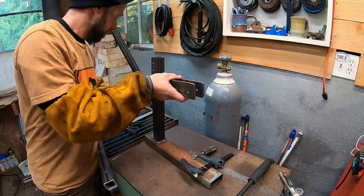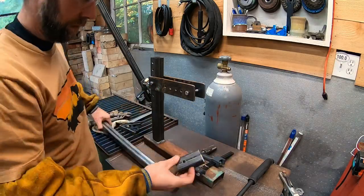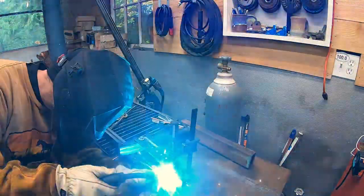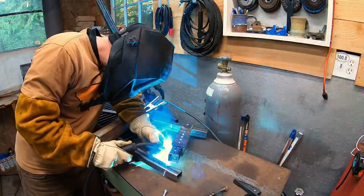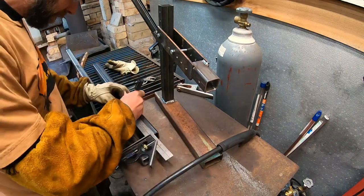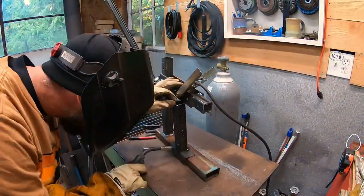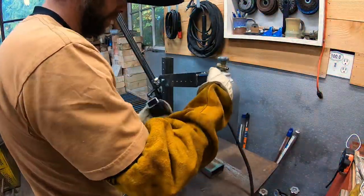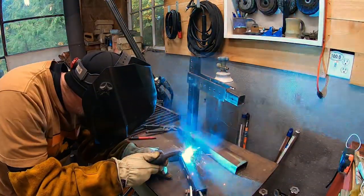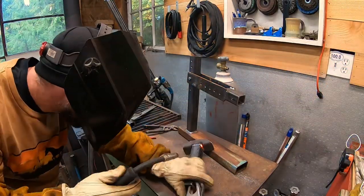This next part might not make much sense yet — those parts I'm bolting on there are bolted onto some inch and a half stock, and I'm welding and clamping more inch and a half stock up here. Later in the build, I needed clearance for more inch and a half stock to slide through. I should have clamped in some sixteenth-inch shim stock and welded around it, but I didn't. I ended up bending those two arms out in the vise around shim stock to give a bit more clearance. The actual bead breaker part — the piece that pushes down on the tire to bust the bead — has adjustable bolt hole arrangements, so I needed that clearance to slide it in and out easily.